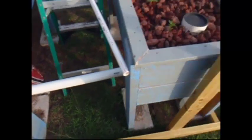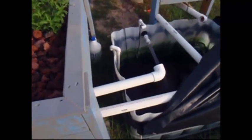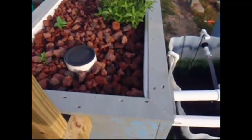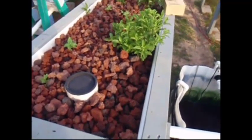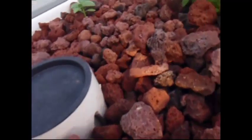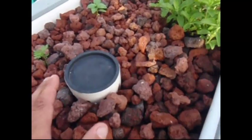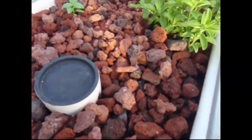Now, remember when I told you about water flow — if you don't have proper water flow, you've got issues? If there's not enough water flow — we had a different pump rated at 1,360 gallons per hour, larger than the one we have now, but it wasn't pumping enough water. It just didn't have enough head on it. Side by side, the old pump does better at about a foot of head, but at 4 to 5 feet of head it dropped off so much there just wasn't enough water.